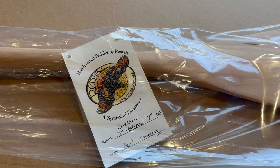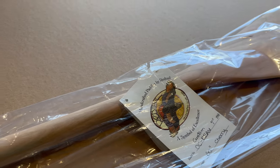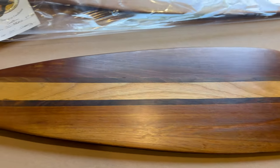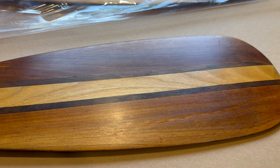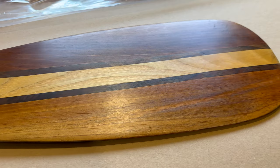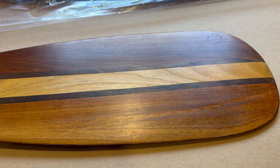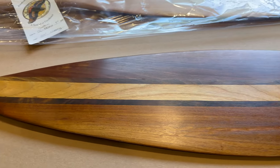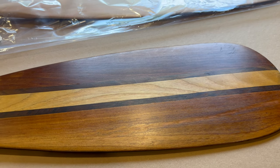The varnish doesn't pile up. I have two older paddles of John's — I'll show you one of them. These are laminated paddles with some different woods. At some point I wondered if I could strip these down, because they had multiple coats of varnish on them, and just oil them. I looked on the internet and basically everyone said no — the glue will come apart, different woods will swell differently and the paddle will come apart. But no one said they actually did it and had those problems, so I thought I'd give it a try.